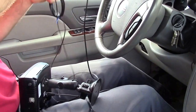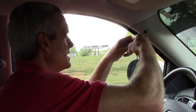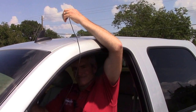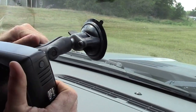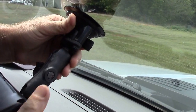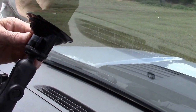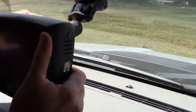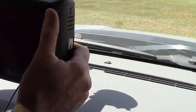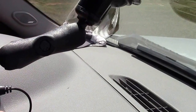Then your antenna would go on the top of your vehicle. I'm in a truck today just for demonstration purposes, so I'm going to stick it outside my window and put it on the top of the cab of my truck. Then you need to suction cup the RAM mount to the window. Press it firmly against there, and once you press it firmly, turn the trigger to securely fasten the suction cup to your windshield. Then tighten up the bolt in the center of the RAM mount to secure the display in place.